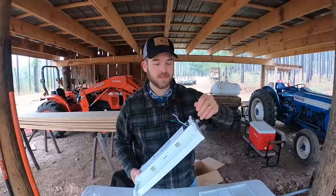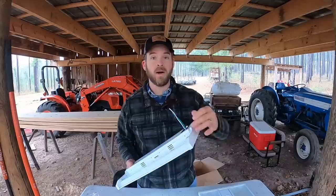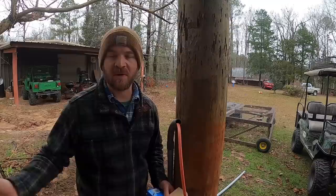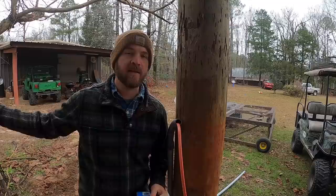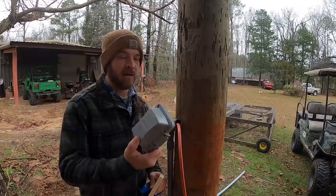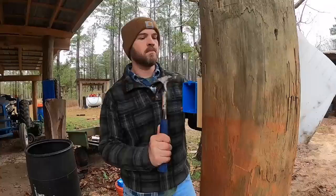So let's do what we need to do to get these set up. I was hoping these were a plug-type system — I was planning on installing just plugs on the top and wiring the switch to those plugs. But it looks like I'm going to have to hardwire them into the wiring that we still have to put up. We're going to put a switch out here, make it as waterproof as we possibly can, and then continue on up and run it into our lights.